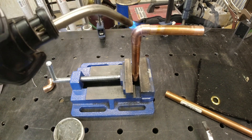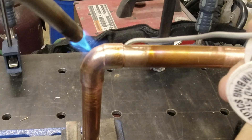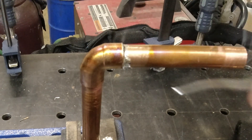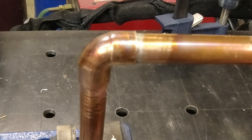Heat the whole thing up, and I'll show you what to do if you're trying to do this next to a piece of wood — say you're in a basement. Put the solder on; it'll wick all the way around. Take a towel and wipe it off. You can see it sucked right in and went right around real easy.